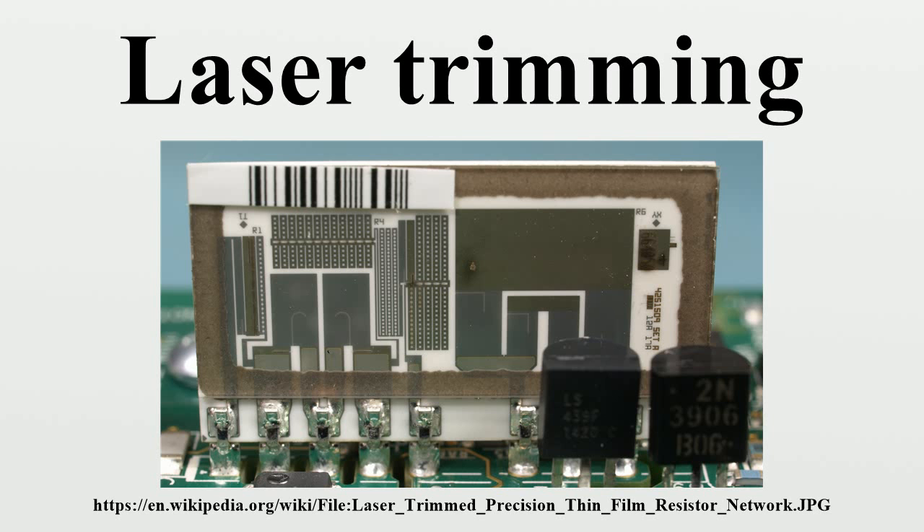The same effect is obtained whether the laser changes a thick film or a thin film resistor on a ceramic substrate, or an SMD resistor on an SMD circuit. The SMD resistor is produced with the same technology and may be laser trimmed as well.